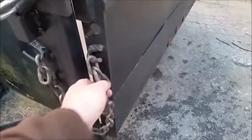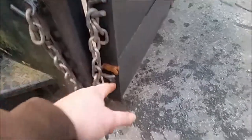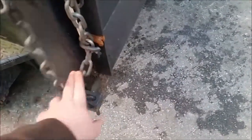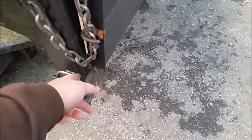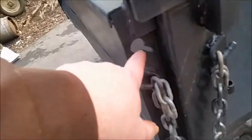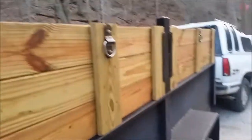I modified the chains and put an extra hook on. Right now it's set up to drop all the way down. I put an extra hook here where I can control it better — so whenever we do the dumping and spreading and I let the bottom out, I can control it from right there rather than way up here. The size chain you'd have to use to utilize those headaches down there isn't even worth fooling with, so that's why I did all this.